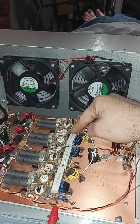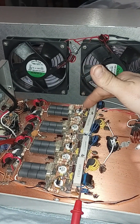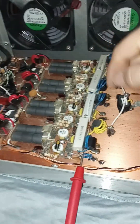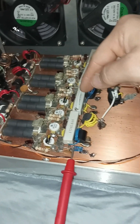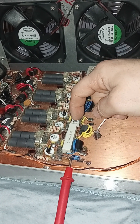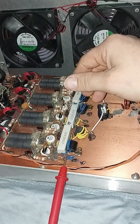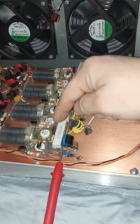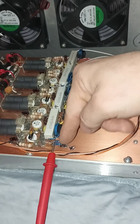I don't see too many other people doing that. Most people do them in chunks of 2. Most of the videos I've seen use 10 watt, 10 ohm resistors. There's not a lot of people out there that show it, other than saying that's what Texas Star does. What they do is a 10 ohm, 10 watt resistor and then a divider of like a 1.8 ohm resistor to ground.